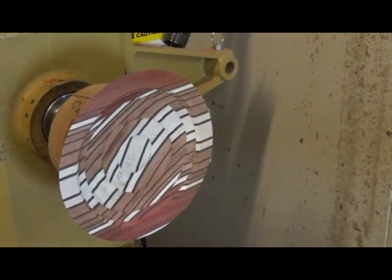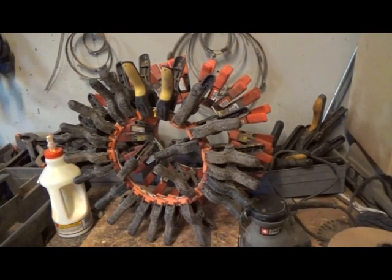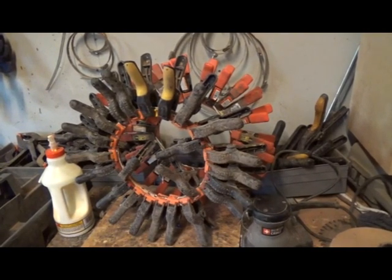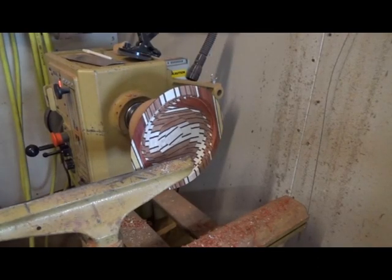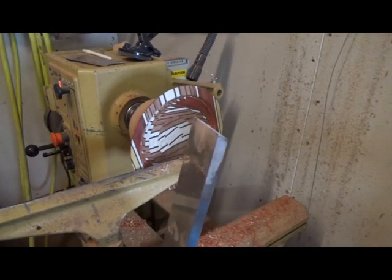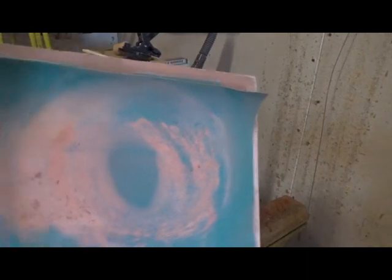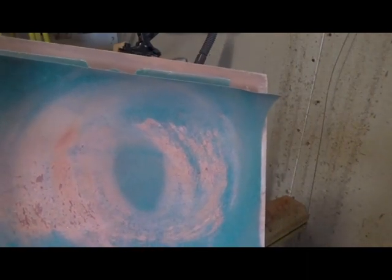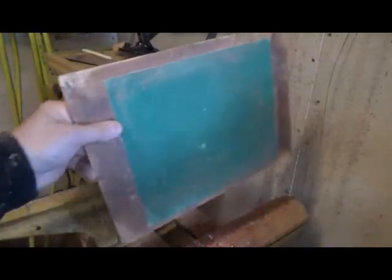Okay, so this is how it looks after seven rows put on — two pairs here. We've got rings 12 and 13 in the back with the red clamps, and rings 14 and 15 with the one up in front. So I usually do a couple. This is showing how I glue each ring on. What I do after every few rows is true it up. I use this tool quite often for truing it up nice and flat, then I run the sandpaper across it. That bloodwood really fills in the cracks and the sandpaper doesn't last that long, so I just go flat against it like that when it's running.